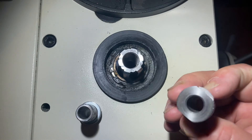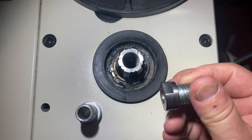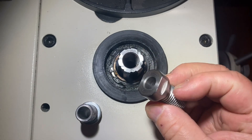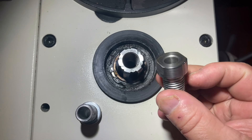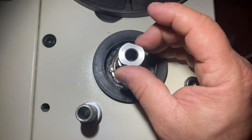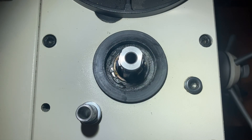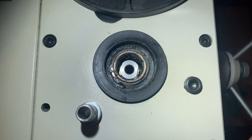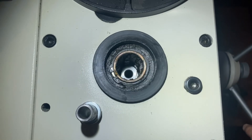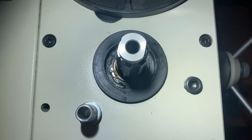I've got both bolts machined. I've got it turned down to about 22mm so nothing's going to protrude out where the splines are. Got the hole drilled as well. Put a couple of flats on there - in case it gets a bit too tight, I can loosen it with a 19mm spanner. So yeah, they'll just screw on like that. And I'll just show you how it doesn't interfere with the spindle going down inside the quill - so it's going to work fine. I'll start working on the shafts, and that'll be done off camera as well.